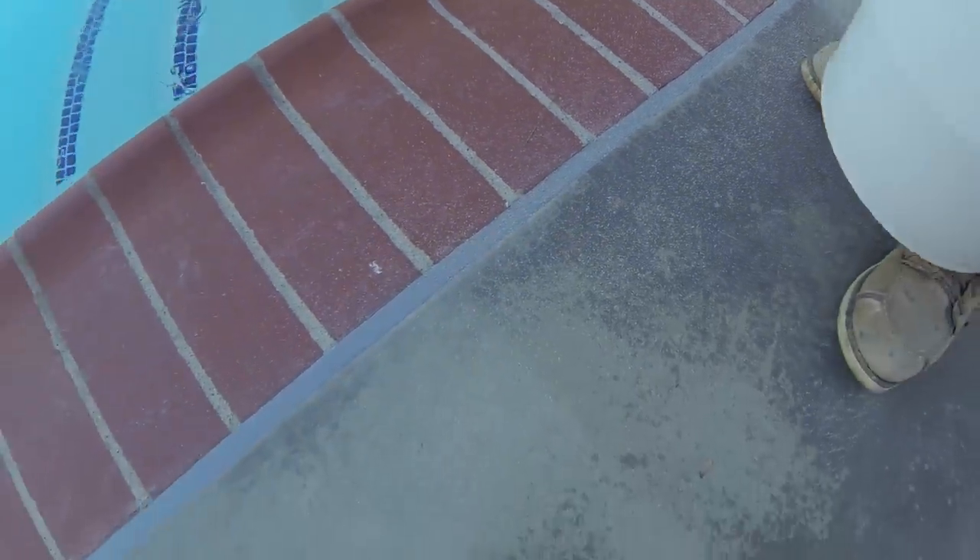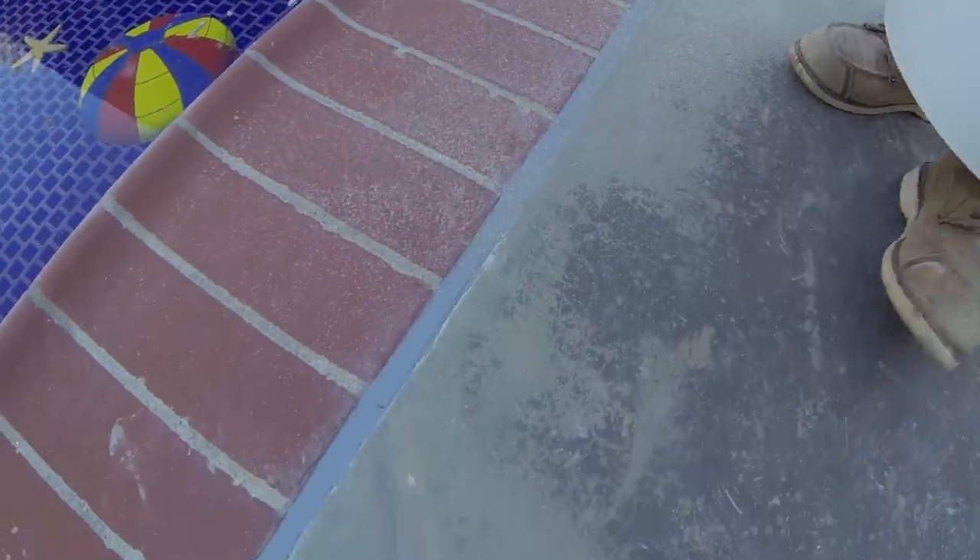Here's the finished product — after we're done, we sprinkle a little bit of silica sand over the top of the sealant. This makes it less slick, provides a little bit of traction, and gives it a good finished look. Everything is nicely filled up and looking really good. Once this all dries in about 24 hours, that sand just gets washed away or groomed away and it's a perfect job.